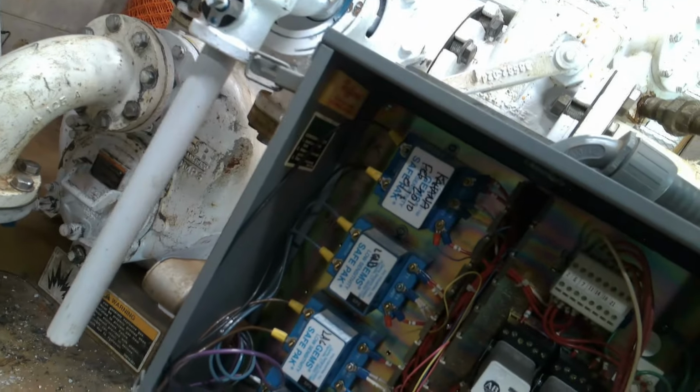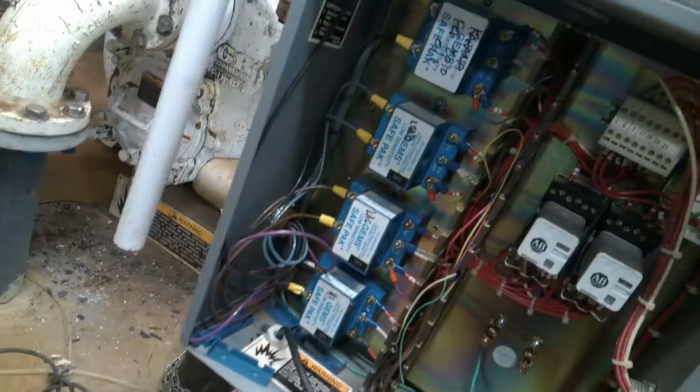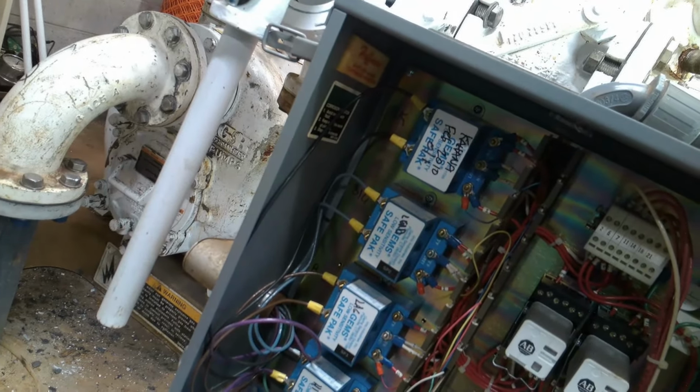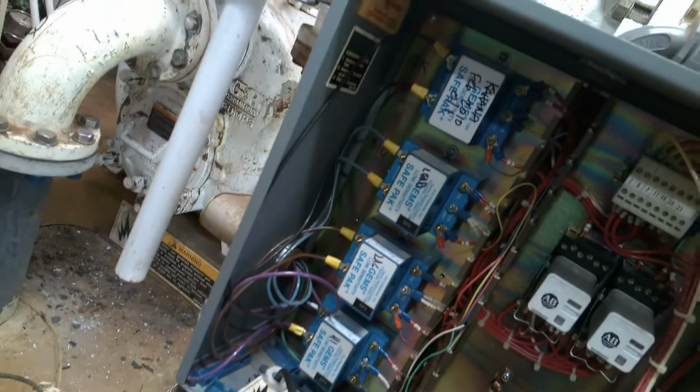Yeah, number 2 is set up to come on when lead is true. So it's funny that when lead pumps, none of that comes on. Yeah, I think the inputs on the Sentinel are toast. So that might be our problem. Yeah, some part of it. And that fourth high float isn't connected to the Sentinel at all.